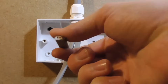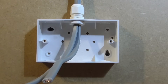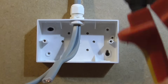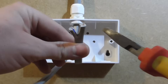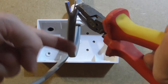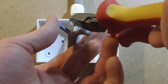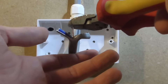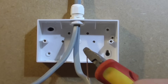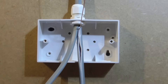Here we have two 2.5mm twin and earth cables forming part of a ring final circuit on this temporary rig setup on a plastic surface-mounted back box. I'm going to show you how to take your side cutters, get the top of the cable, and just make a small cut in it. This grey outer is called the sheath — it's just extra protection for the cable against nicks or chips. You want to reveal the three cables here: the live, neutral, and earth. With the earth, take it out slightly and pull upwards until you get to the top, which will strip the sheath off automatically.